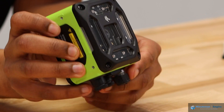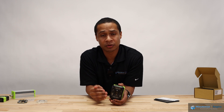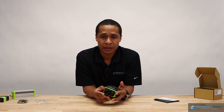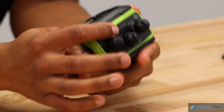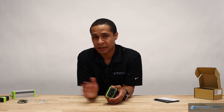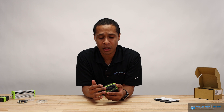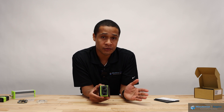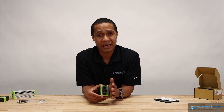Also included in this camera is a laser aiming diode. Since this camera can be located fairly far from your product, an LED aiming diode would become too diffuse, so the laser system allows you to project light and stay sharp. There's also a USB-C port on the bottom. If you want to plug this into a PC or another USB device for data streaming out the barcodes or codes you're reading, you can connect it there. This port handles up to one gigabit of information. You can also buy an extra module on the back for dual Ethernet — one cable going to your FTP server for image storage and another going to your PLC or management device — making it flexible and scalable.